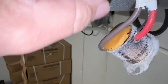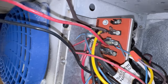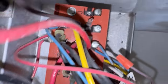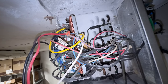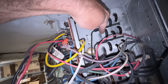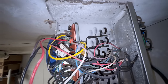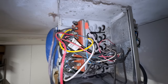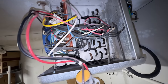All right, so we've got it here. That switch mechanism and stuff in there is bad. It comes right out here to these wires: black for fan, brown for termination, red is going to 'in.' All we gotta do is replace that switch, put the defrost at 45 minutes. If you're having problems with it terminating you can move the switch closer to the elements, or move it higher — heat rises — and that'll cause it to shut off quicker. Don't do stuff like this — half-ass work is not going to get you anywhere.